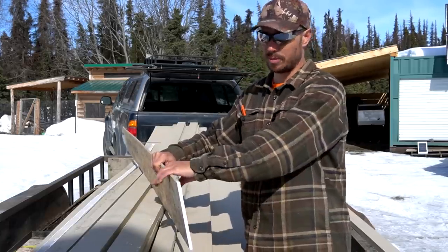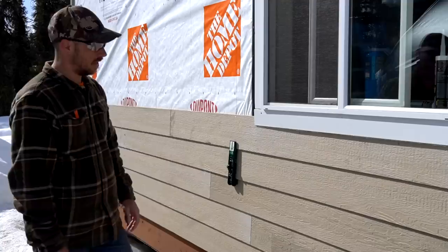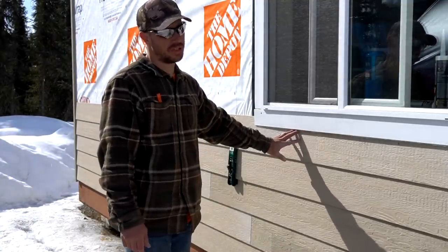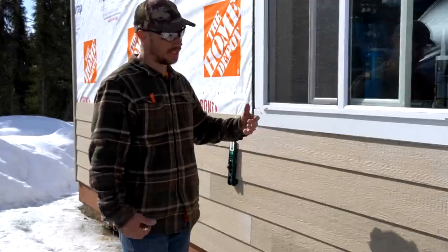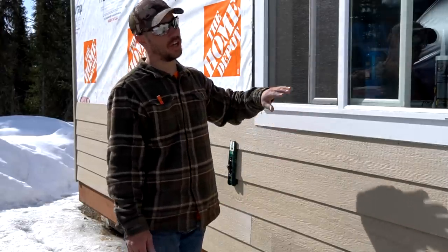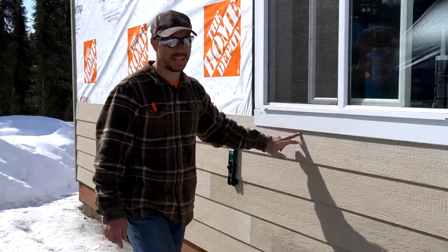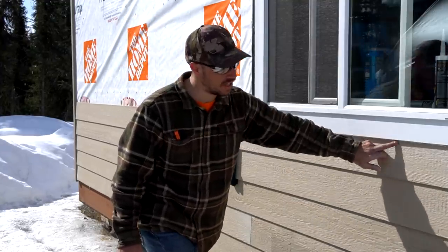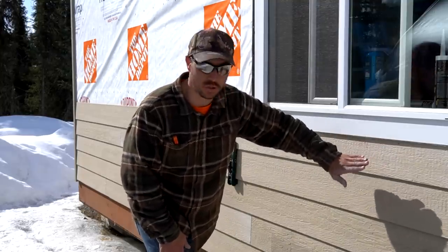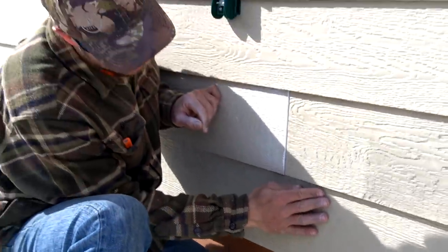We've got to do a lot of cutting to get them to fit our cabin perfectly. We picked up a whole trailer full — 112 pieces of siding and a whole other stack of trim. We've got five layers done so far. This is our first time doing it; there are a lot of precise cuts, a lot of measuring, and a lot of prep work. The studs on this cabin are spaced 24 inches apart, and we have them marked on the house wrap. Each piece of siding gets nailed every 24 inches right into the studs, and we're doing blind nailing — nailing it up high on the siding so the piece that goes over covers the nails.